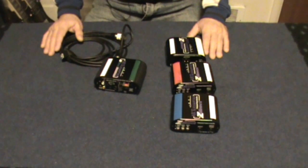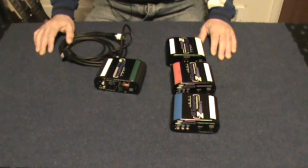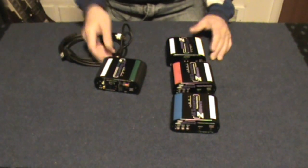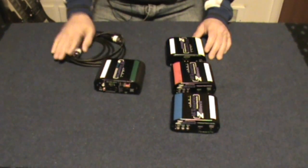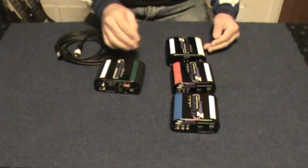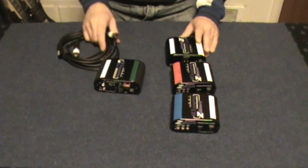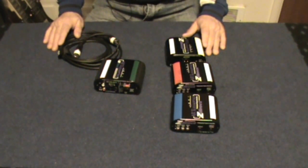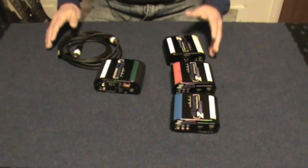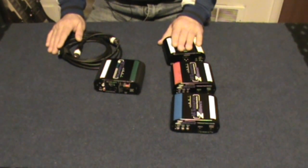Keep a supply of these. I believe you should have a minimum of three, and then one for any other electronic devices that might be used during the show. That's less than $150 and you're equipped to handle pretty much anything on stage. To recap: a DI box goes in as a high impedance signal and comes out the other end as a low mic level signal for running to your mixer through your snake. You use them for guitars, bass, keyboards, drum machines — anything that you need running through your PA system that comes out as a high level signal needs one of these boxes to convert it.